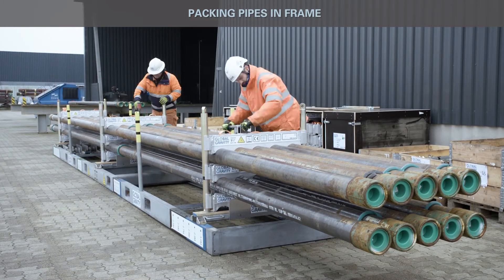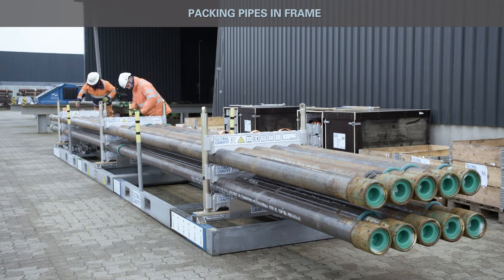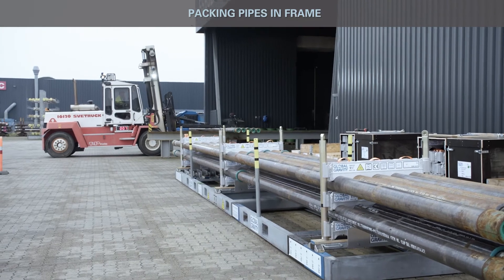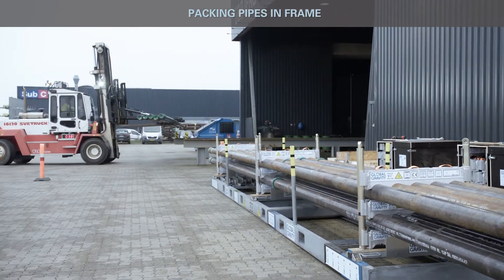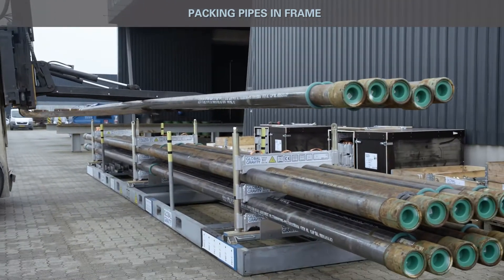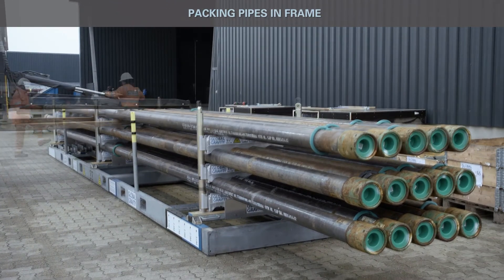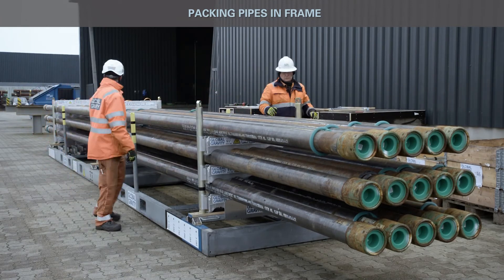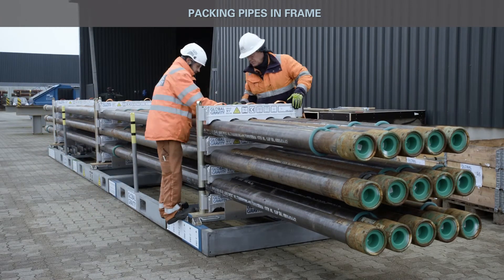Repeat make-up sequence of torquing bolts to 150 Nm, followed by moving the sleeve to the activated position. Next layer of tubulars can now be laid out if it is a multi-layer configuration. Install next layer of H-profiles and make up M20 bolts to 150 Nm as shown earlier.